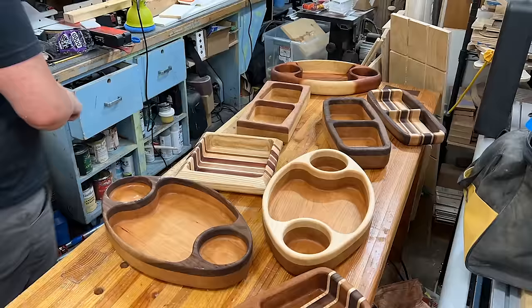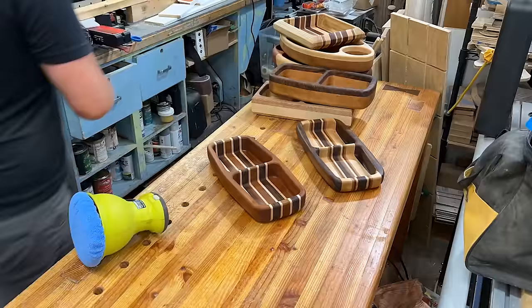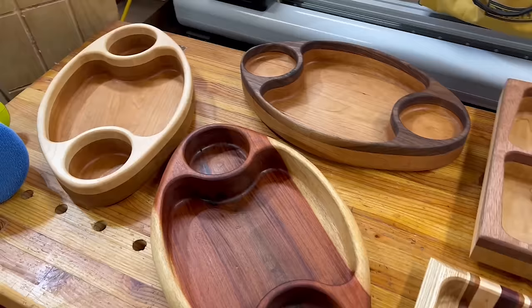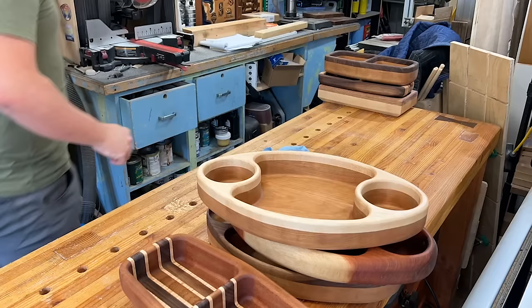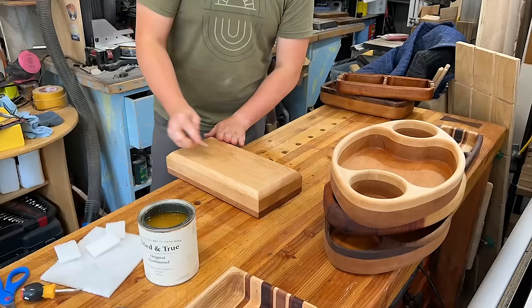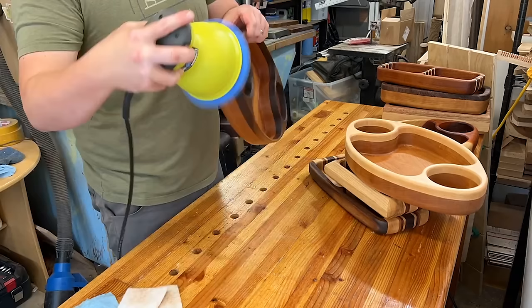It's kind of like hard waxes — it's got beeswax. After the first coat of finish, I usually like to sand at 320, so I did the same here — sometimes this finish recommends burnishing after the 24-hour cure, so I sanded everything at 320 and 400 for extra smoothness. You could also burnish with steel wool or synthetic wool. Then apply a second coat — light. They recommend two or three coats; I went with two and it was great. But apply however many coats you want, buffing and burnishing each time.